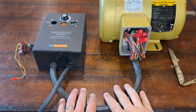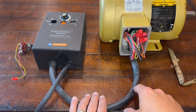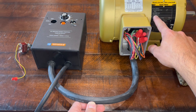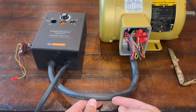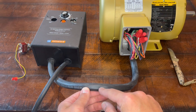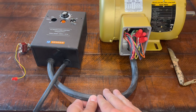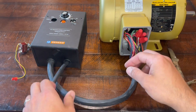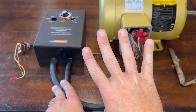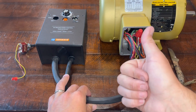All right, let's talk a little bit about wiring. What I have on here is 12-gauge wire, which is probably a little bit overkill for the amperage. As you go up in voltage, you're going to need less amperage to run it. At 230 on this, I'm only running 2.8 amps. So really, if you get a properly rated 14-gauge wire, that's probably all you need. I just like the 12-gauge wire — a lot of them have better coating and they're a little more durable. That's why I went that route. For three-phase, you're going to need three leads plus a ground, so you're actually going to need a 12-4 wire. Basically means it's 12-gauge and you've got four wires inside the one big wire — your ground and then three leads.